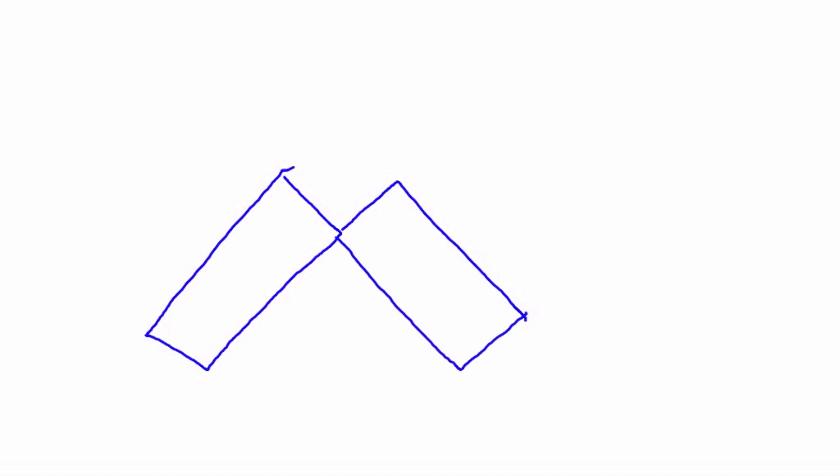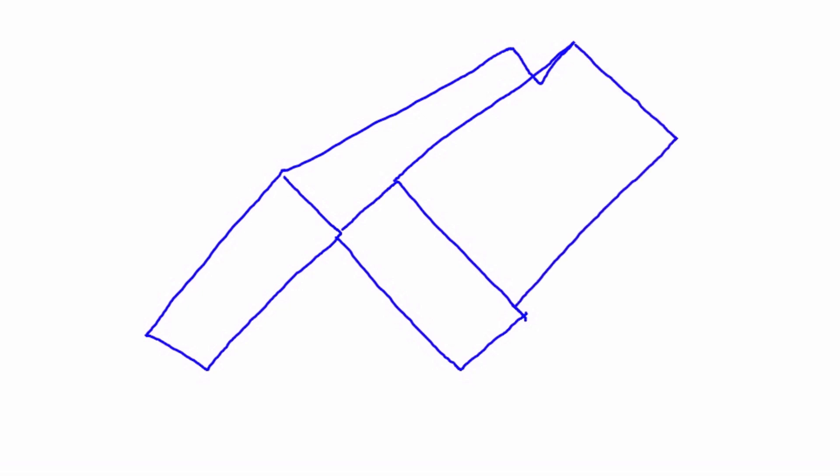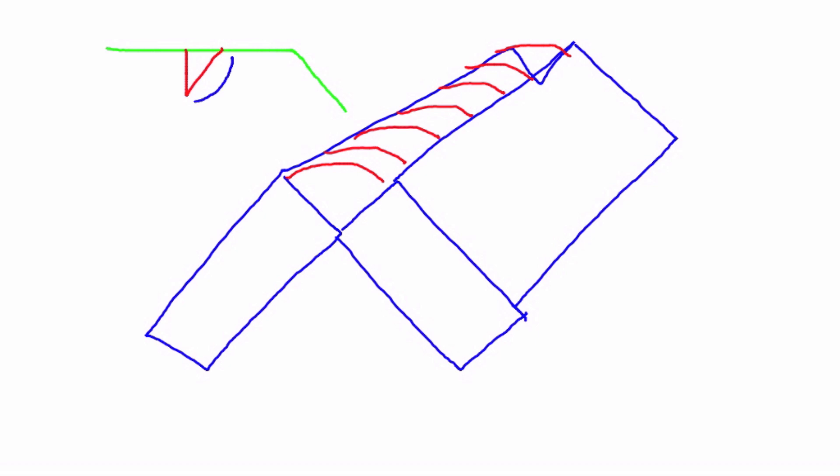To make the weld I set up a corner joint — this is frequently called an open corner. I got some 3/32" 4043 filler metal, and the material I was working with was quarter inch 6061. Then I came in and put the weld in and applied it just like this. If I had a weld symbol, it would look something like this — a fillet weld on the arrow side with a convex contour.